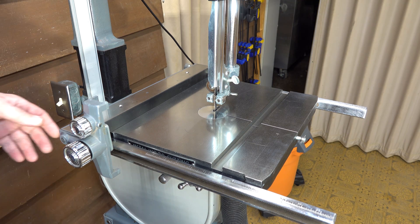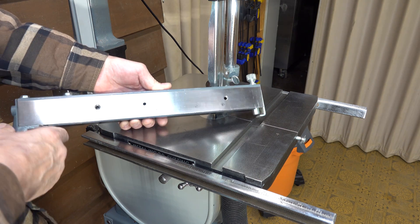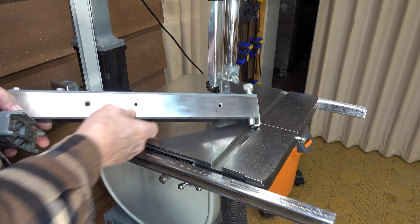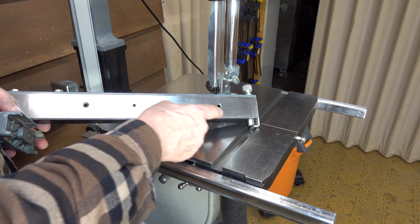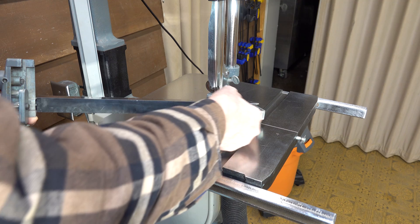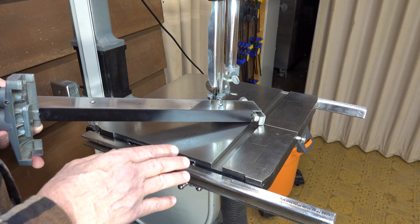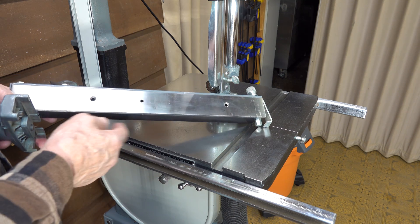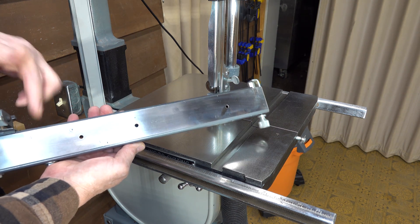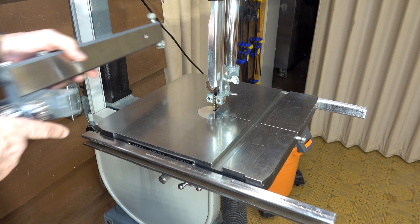Next was the fence itself. What I did was I stripped the paint off of it and got the bumps out from their spot welding of the pieces in between. Then I also put a bottom on it. So this is perfectly flush with the table so you can saw the thinnest veneer you want to saw and it won't go into the fence. Both sides were done that way, polished up, and it really helps a lot.